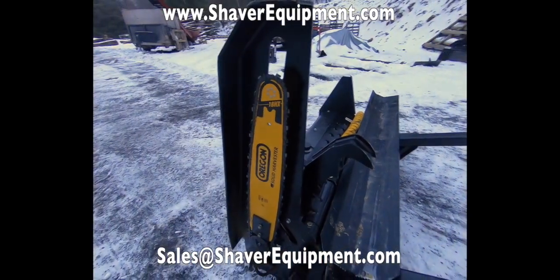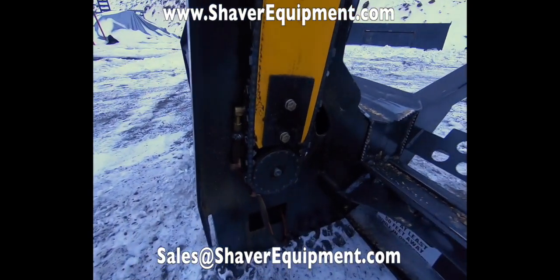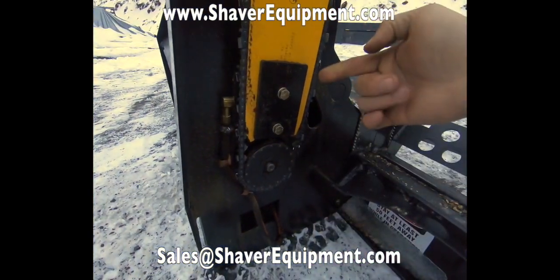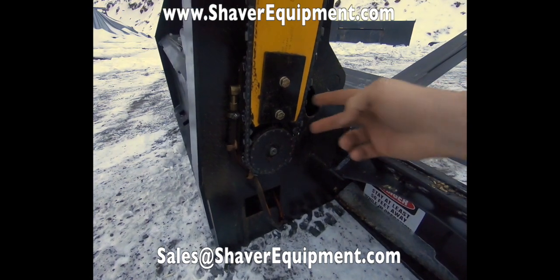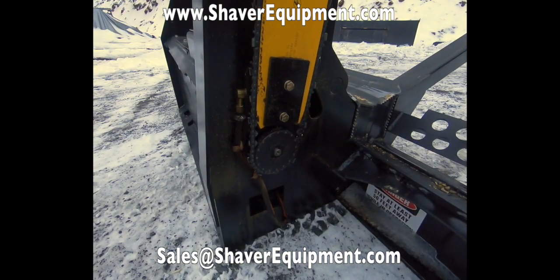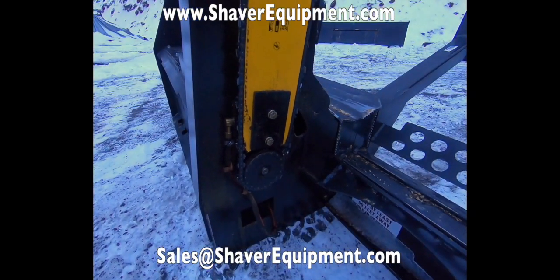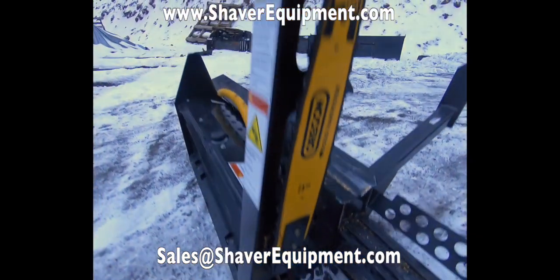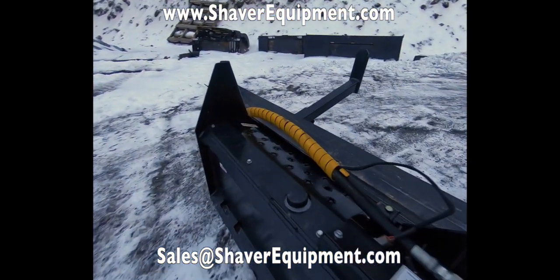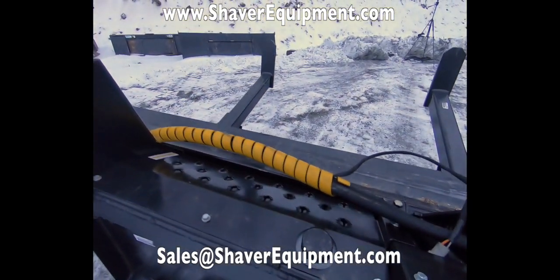The oiler on this is recessed, and while I'm on this side, you'll notice also the saw motor is on the inside of the unit, which makes changing the chain a whole lot easier on this. You just have two 14mm bolts there, and then your standard flathead screwdriver for chain tension on the inside of the bar. So here's the recessed oiler down inside the punch tread plate.